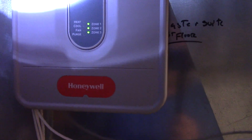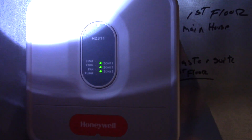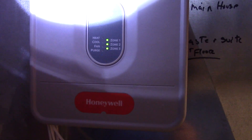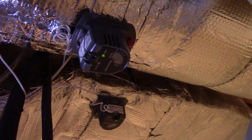Basically what happens here is, when I turn on the thermostat for heat, the heat LED, which is red, is going to come on, and then zones two and three are going to go red, and then the zone two damper is going to start to close. And then once the burner shuts off and the blower is still running, it's going to go from heat to purge, which is an amber LED. And then once the blower finally shuts off, after it's removed a lot of the heat from the heat exchanger, the purge light is going to shut off, and all three zones will go back to green, and the zone two damper will open right back up.